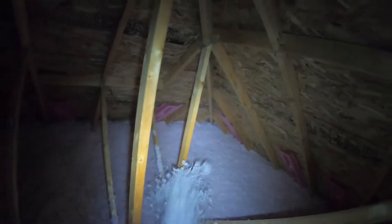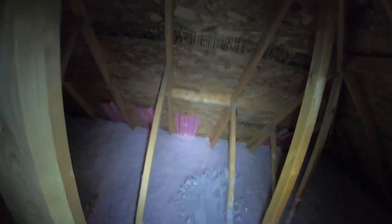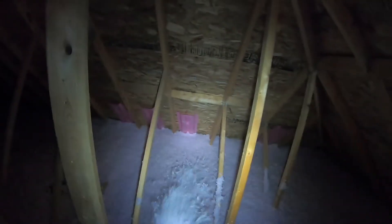This is basically what I do for every house. I'm an attic insulator and I work with Owens Corning fiberglass — like you see here — Pro Pink. Right now I'm installing an R60, which, with the new CCMC number, is 21.5 inches in depth that I need to install in order to achieve that R60 of thermal resistance. I do that for all the new builds.